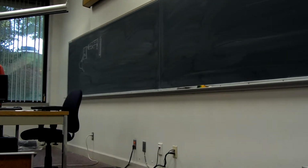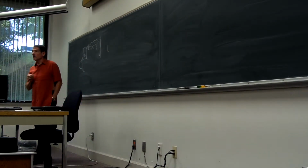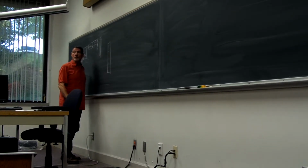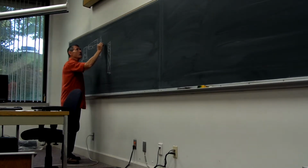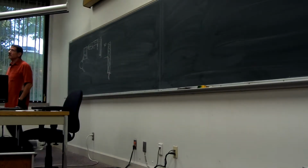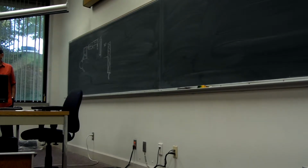More flow? Well, why exactly is the pressure related to the position? Because if it were a sealed tube, I would assume that the pressure would be the same throughout the tube. The answer is no. Pressure drops as a function of distance. Do you remember in 402 lab you made a resistor? You made this resistor a quarter inch wide, 3 inches long, and it had resistance. If you put 5 volts up here and 0 volts here, what would be the voltage in the middle of the thing? It's exactly the same situation here.